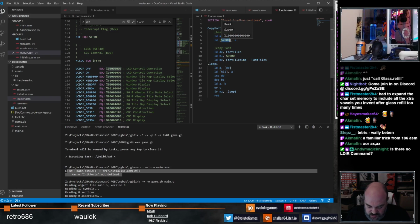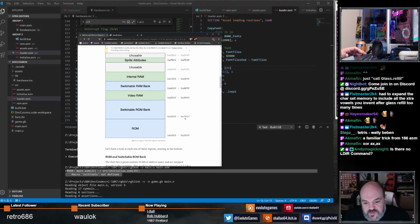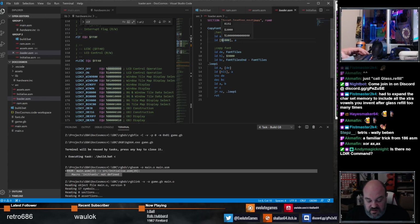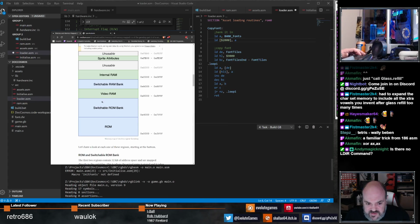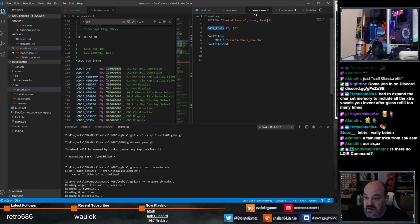Now remember what I said about how, because it's ROM, you can't write anything to it. Now the Game Boy has, let me show you this area here. So the Game Boy has ROM all the way up to 7FFF. However, if you write a value into any location in lower ROM, I think from 2000 to 3FFF, it basically switches the bank for this one here. That's its only purpose. This could be 2000, it could be 3FF0, it doesn't matter. Any location in this area will switch the bank that's being used in this location, in this switchable ROM bank. So this is how we bank in the ROM that we need. So we're banking in this piece of ROM here,